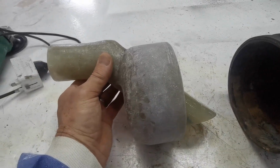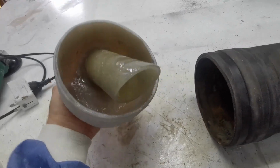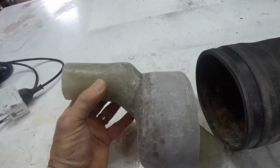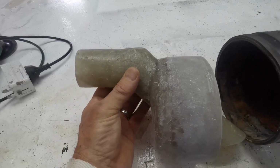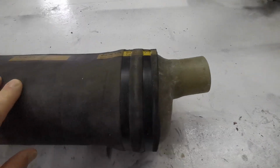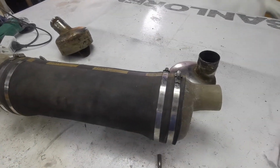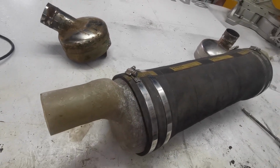Outlet, that sits up the top, nice and solid, nice and strong, same inside shaping as the Volvo Penta unit, but I've changed the outlet to give me a far better angle to get the exhaust tube on. This has worked out brilliant. I'm very happy. And here's the final setup. Got the stainless steel bands to go on yet. Look at that. Very nice. Alright, that's it back together. And I'm ready now to go install it in the boat.